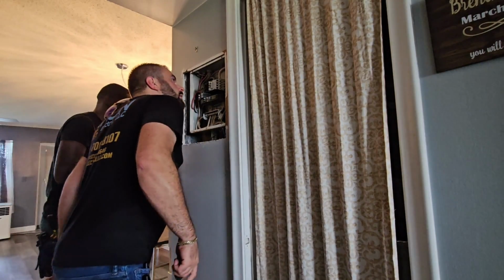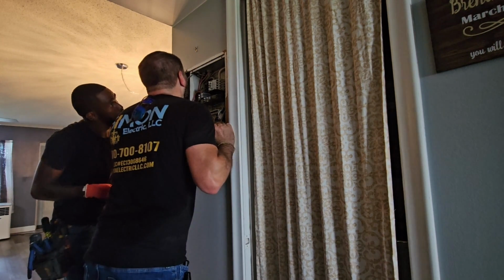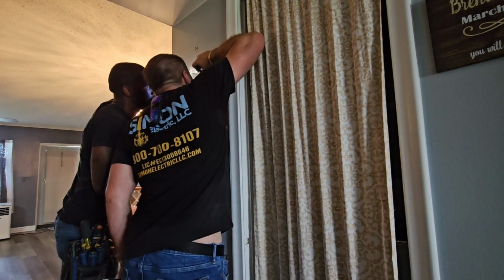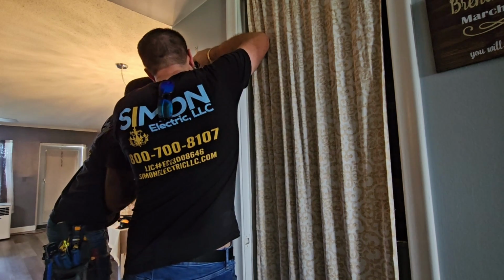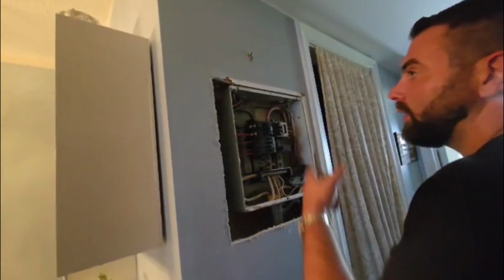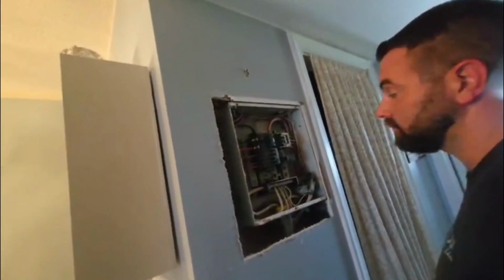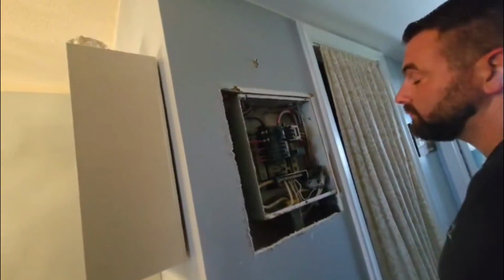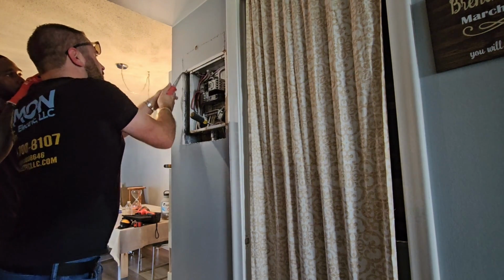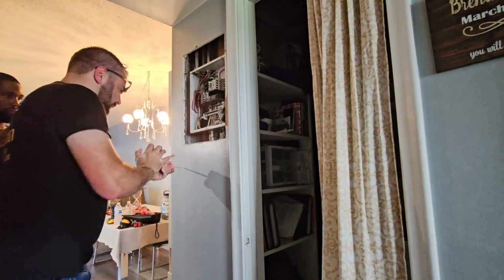I'm gonna get these things off, though. Look, are they crimped on? Look right there. Bingo. Crimped on, I think so. Whoever installed this panel took a tiny flathead and pinched the threads on every single one of these lock washers. Stuck. See that? Yeah, crimped on. Probably gonna have to cut the top, tie to the top and then get EMT connectors. So much for my dreams of a perfectly fitting panel with no drywall repair. We're cutting it bigger on top and bottom so we can remove the lock washers from the EMT conduit itself and just slide them off the pipe.